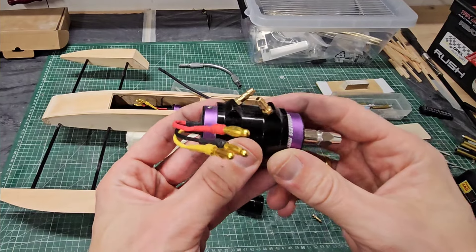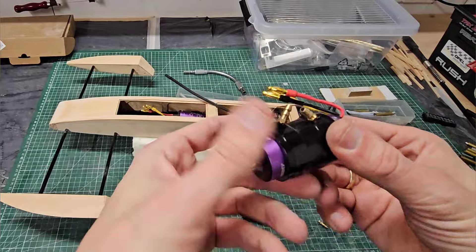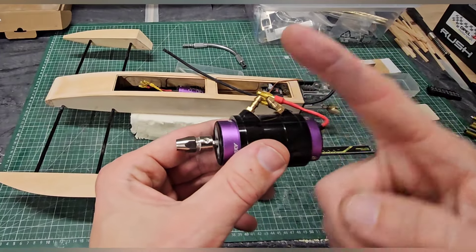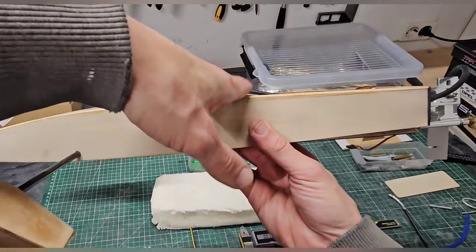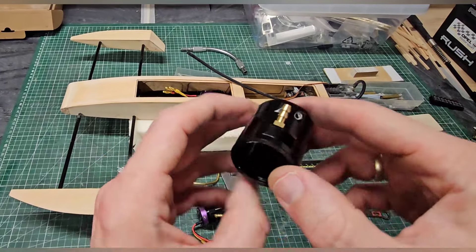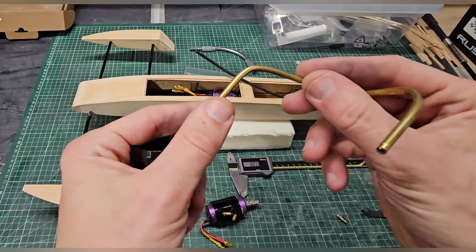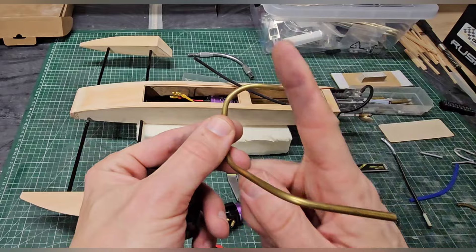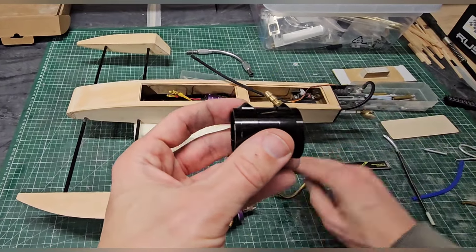This is the motor we're using in the shrimp rigger — it's a 2958 motor, and this is the cooling jacket. The issue with this cooling jacket is that the water in and outlets are facing up too much and therefore sticking out too much of the tub. So I disassembled one of the inlets and I'm going to drill a hole through, then put a piece of 4mm brass tube with some bends in it, cut a bend section, and put it in — that will lower it.